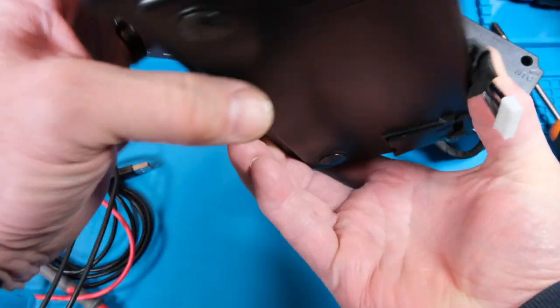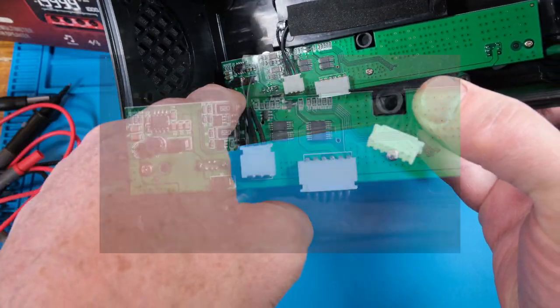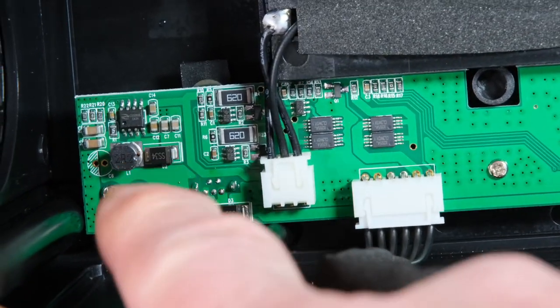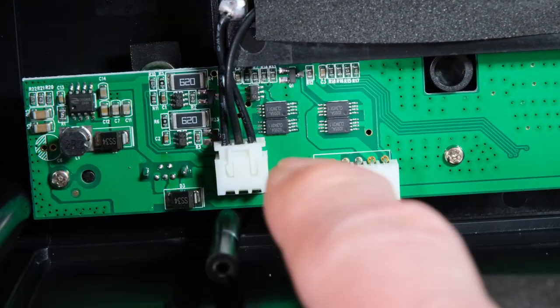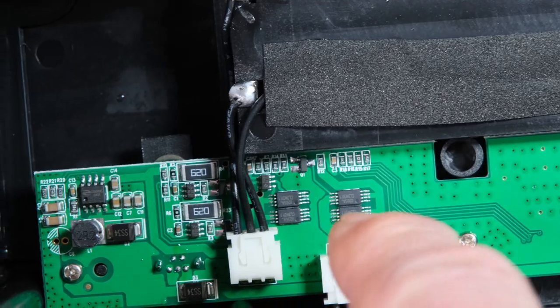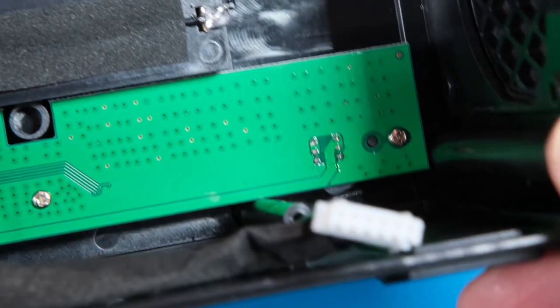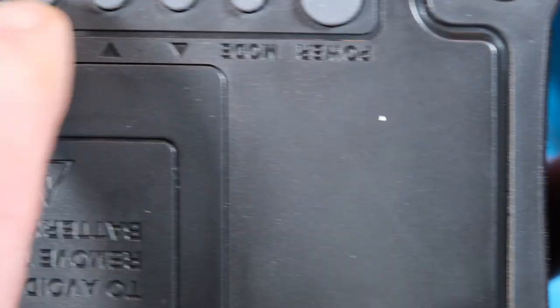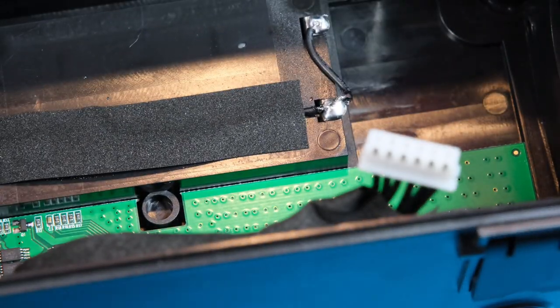And this right here is the input charging station. Comes right here. All right, guys, just zoom in so you can see the inductor down here. This is where the charging is happening for the batteries. Some little MOSFETs to turn on and off power to the meter, I guess. And it's interesting that the board goes all the way back. I guess there's the buttons up here, that's why. So we got the buttons on the other side. And there they are. All right, that's pretty cool.